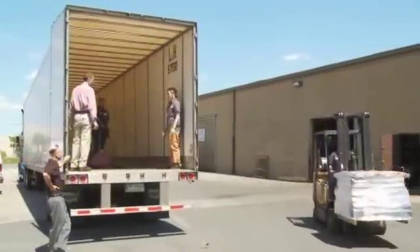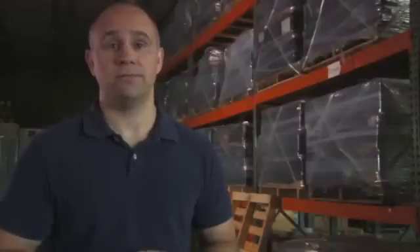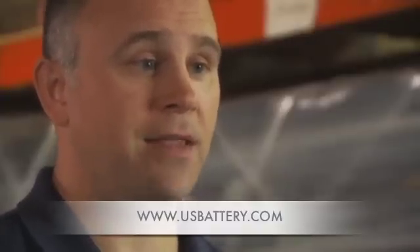Welcome back to our automotive product store. Recycling lead-acid batteries is a key service we provide to our customers. It's important that we remember a few things when loading and securing used lead-acid batteries being shipped for recycling. The wrapped pallets of batteries should be loaded or braced in the transport vehicle to prevent damage and short circuits in transit, preventing lateral, forward, and aft movement and batteries breaking free from the pallets or tipping over. No other hazardous materials may be transported in the same vehicle. Any other material loaded in the same vehicle must be blocked, braced, or otherwise secured to prevent contact with or damage to the batteries. All of these steps help to maintain your own safety, highway safety, and the environment. Please ask your employer if you have any questions about this presentation.